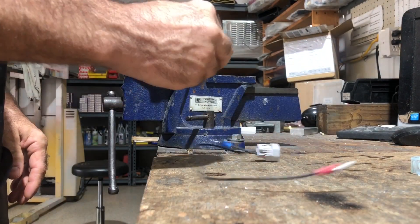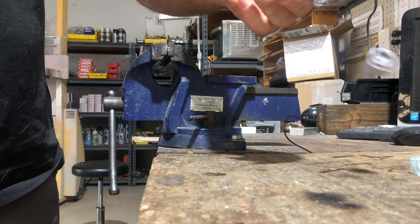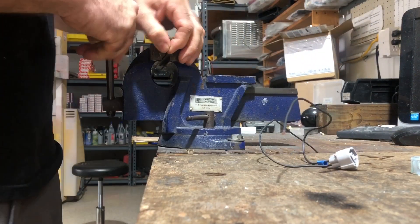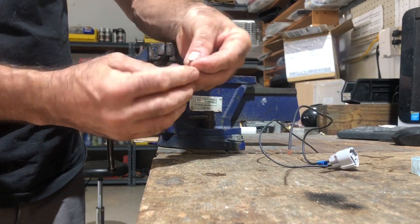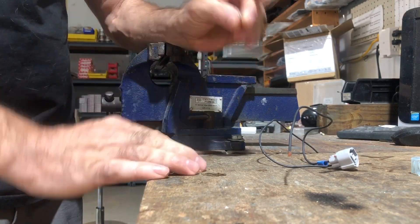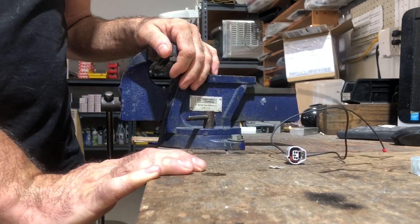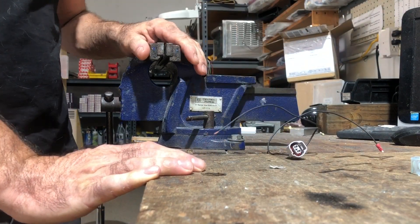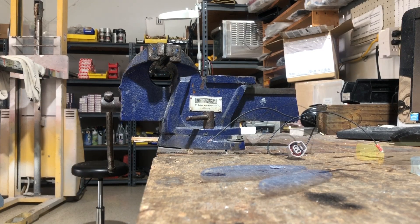This is not safe. Let me pull on this wire — it pulled right out. It didn't break the wire, it just slipped right out of the terminal because it doesn't have a proper crimp. You might as well just slap it with a hammer. This means that everything in your airplane that's been wired so far has to be redone.